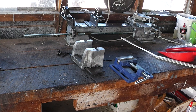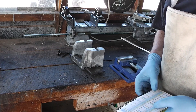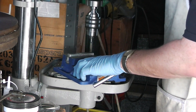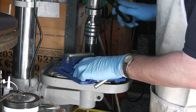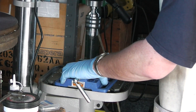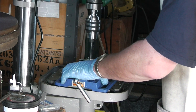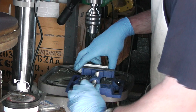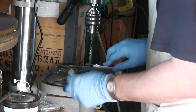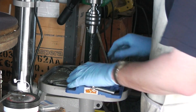I've got the flat resting there so the hole will be 90 degrees relative to the flat bottom. From memory the tap size is 7mm — well, 6.8mm, but 7mm is the closest I have. I might be dreaming but it seems like this Zamak likes a fairly fast feed rate as well as speed.